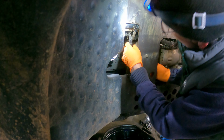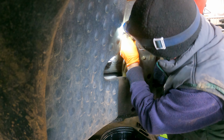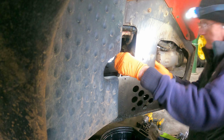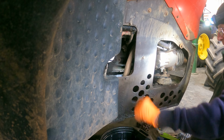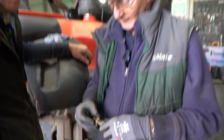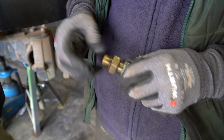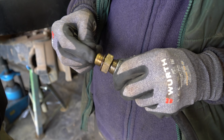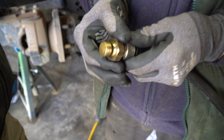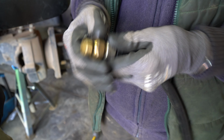Because of where it is, it's in a hole in there. If it's an ordinary bung and you pull it, you would just flood the tray. So what they do is they supply these with them. They're clipped on there behind, in front of the radiator. Well, they're normally clipped, but they keep disappearing. That screws onto that and pushes this valve. Well, it's supposed to push that valve back, but watch what happened here. And there's where our leak was. So it split.